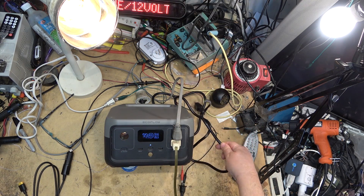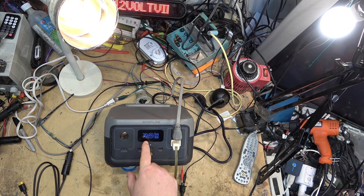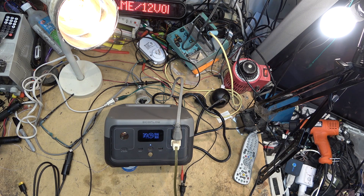Plug it back in and it'll switch back over — we're back onto mains and it'll recharge the battery again as soon as the power is restored. Interrupt the power again and once again we're back on battery to show how quick the switchover actually is. This is a standby supply as opposed to a true UPS. As a real UPS the load is always running on the inverter and the power supply is feeding the inverter so there's no transition. The River 2 switches in less than 30 milliseconds.